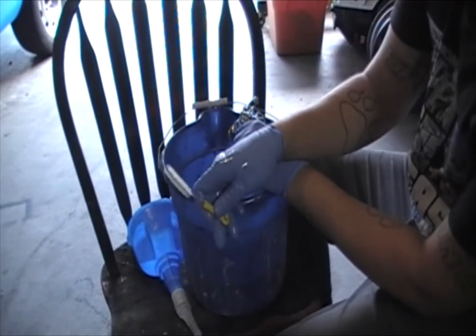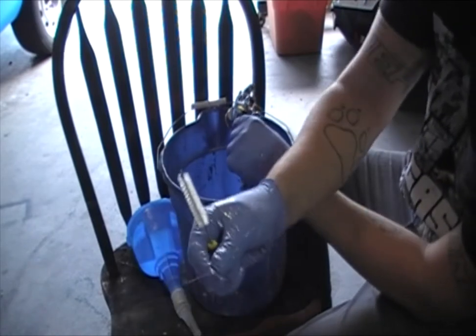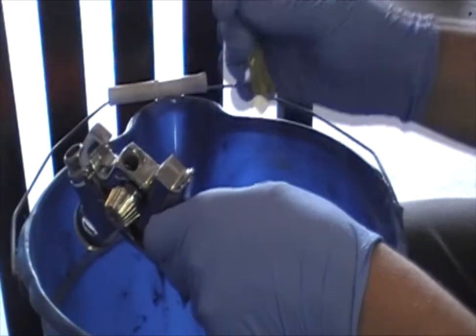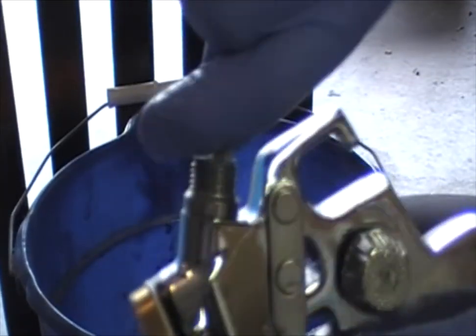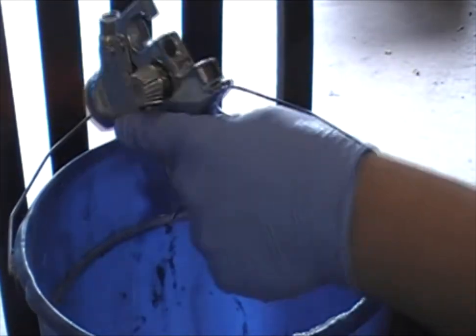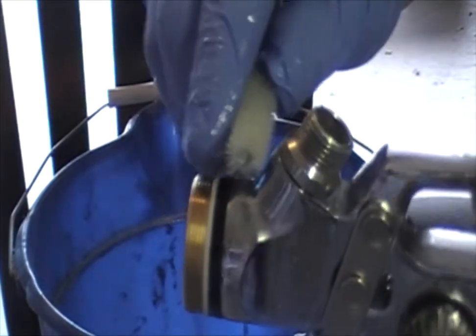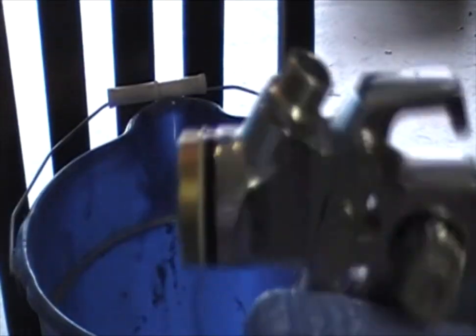Your paint gun should have come with a couple of tools. This is just a wire bristle brush, and there's also a needle that you can put in — it's really helpful to clean out the tiny passages. What you want to do is take the bristle brush, dip it in your solution, and go in there to clean the top passage where the paint flows through and pull out. After each time I brush it, I dip it again to get whatever I've broken off. Then go through the front of the nozzle, make sure you get all your threads as good as you can. Just go around, use your eyes — get all the paint out. That's the whole idea.